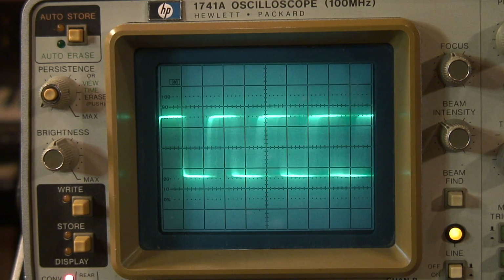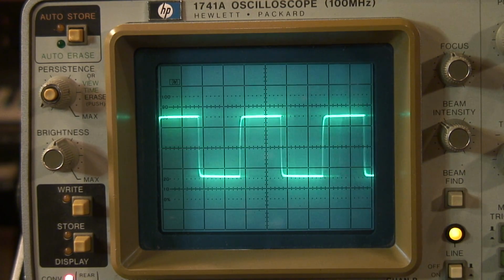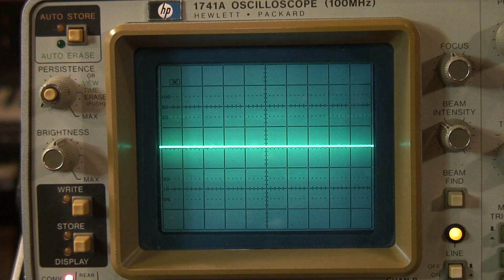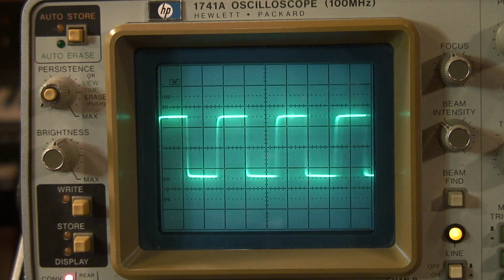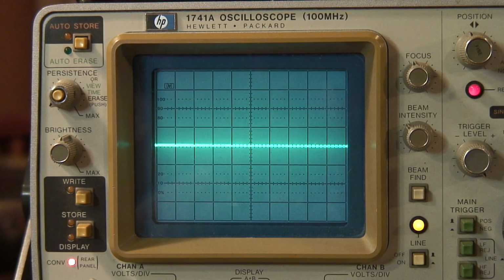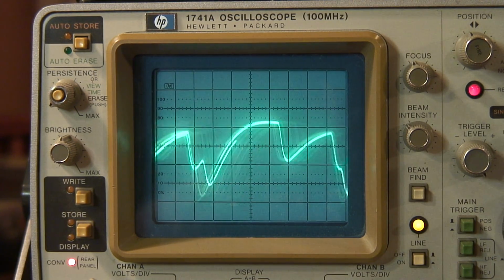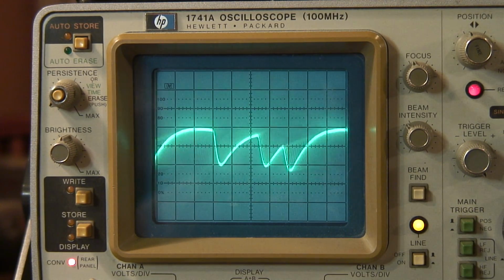This is the clock on the first BBD modulated by a fast LFO. And this is the clock on the second BBD with a fast modulation, but one that's not as deep as the first clock. And finally, this is the third BBD with the slowest clock modulation, and these three delay stages together give the phaser circuit its distinctive sound. Here's the audio output waveform of one of the string sounds being played alone. You can see the phaser effect. I'll press the phaser chorus button on the front panel to slow it down so you can see it in more detail.